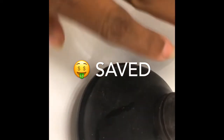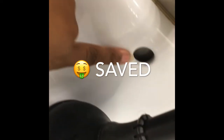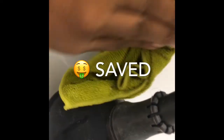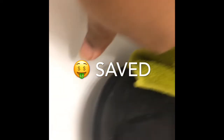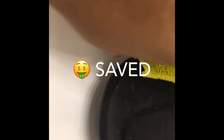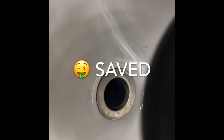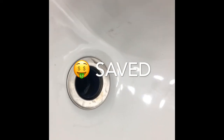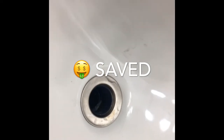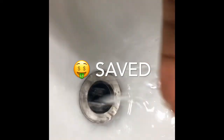Then I plunged, put more water in, plunged again, and covered this hole really tight so that I would have the pressure in the air going right through the main drain here. And the next thing you know, guys, it was clear. I was like, oh my gosh, thank you, Jesus. It's clear. All of it's clear.